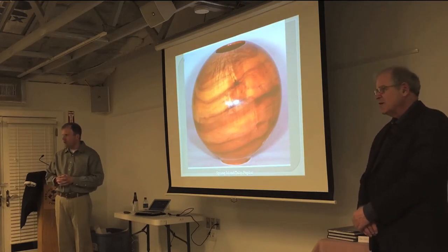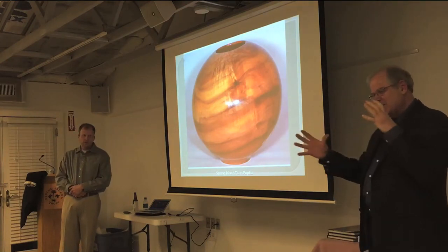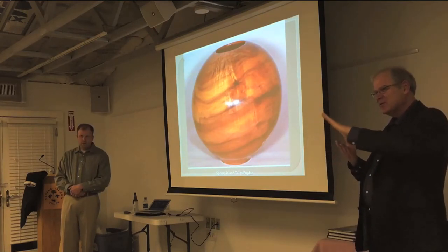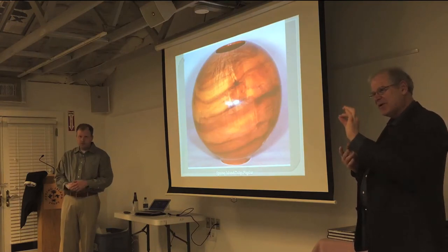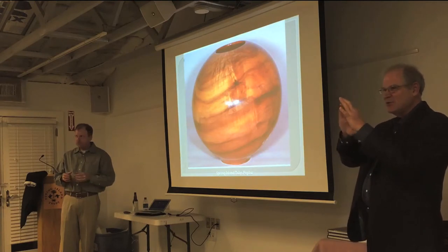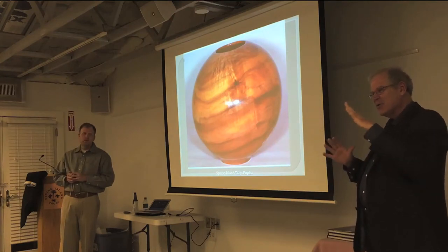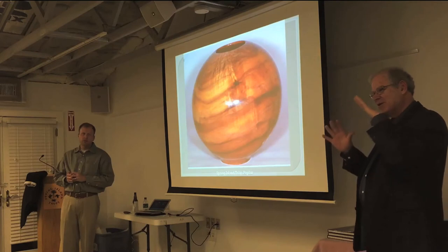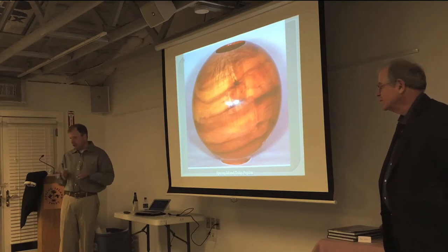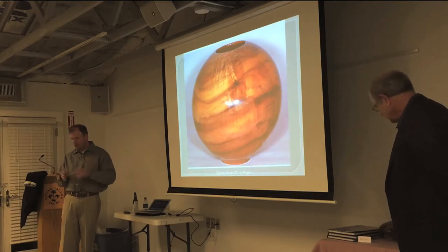To incorporate that, you find burls sometimes have this problem a lot because they have bark going in and out. Even as you turn it, you'll end up with all these places around it. And we'll save all the dust from sanding and mix it in with the bark to fill that. But if it's too big, you don't want an area, say, this big that's just purely filled in because it's all plain and that doesn't look natural. It needs to have some texture. So we'll try to find the same bark off the same logs to go in that. Now, a burl is a cancer growth on a tree. Burl's used in the commercial wood industry, for car paneling and boats and stuff like that. So the wood you see is really highly figured burl.